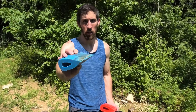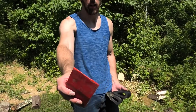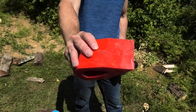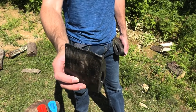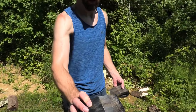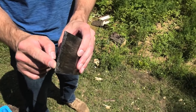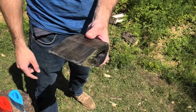Last place: blue PLA+ — it took the most damage. Red Super PLA+ basically tied with Polycarbonate; it's a little weaker but holds its shape better. Polycarbonate has great strength for being the lightest, but it's also the hardest to print. Carbon fiber is the winner of the day — the benefits of PLA combined with the reinforced strength of carbon fiber makes the edge more durable.